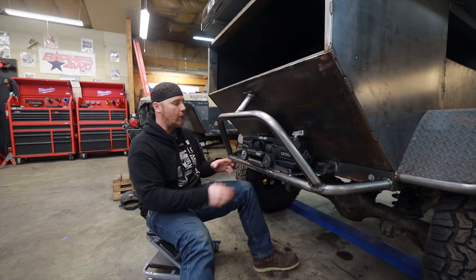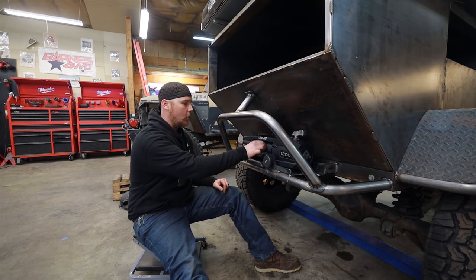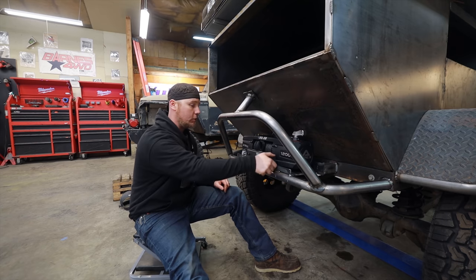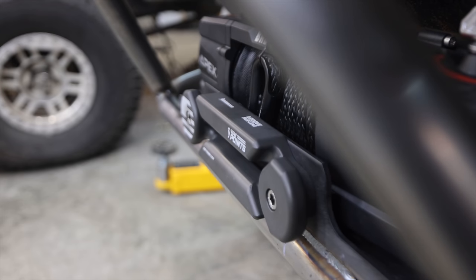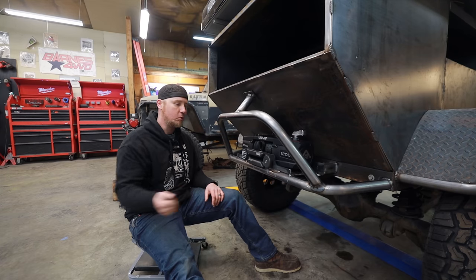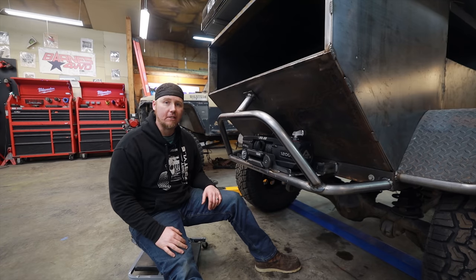The Cliff Notes version of why you would do this is you can eliminate your hook altogether. So in the next video, we'll cut out the steel that's on the end of this loop, and then we'll just take the loop, tuck it right there. There's no hook sticking out. There's no more metal involved at all. We'll just use this, hook it to a strap with a soft shackle. It's as safe as it gets and as clean as it gets.